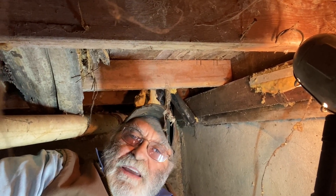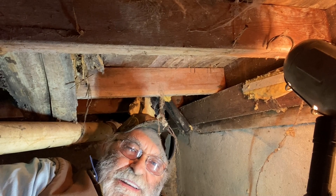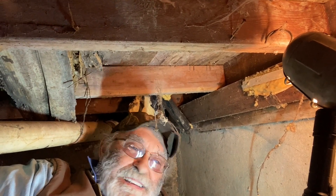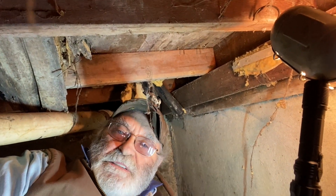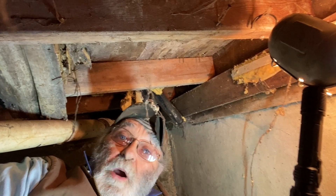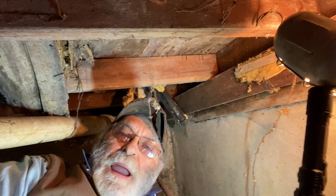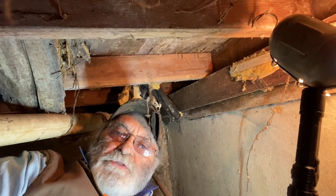I don't have a tripod, don't have a way to hold the camera. I just thought I'd let you know that all is not fun and games all the time out here on this particular ridge in the eastern Midwest. Got to go about the business to clean up a couple pieces of copper, cut off, trim off some bad spots, and eliminate the faulty or blown-apart SharkBite fittings — some of which actually had the stainless steel retainer inside bent over backwards as they expanded and blew apart. People don't realize how much force frozen water exerts.